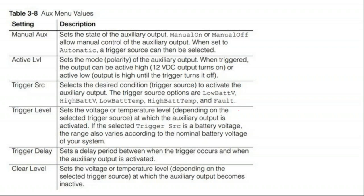And so the hardwired relays and circuits, there is some of that functionality built into battery inverters, just like there's that functionality built into thermostats. But it's a very binary level of control. If this state is like this, turn off. If that state is like that, turn on. And then not much additional flexibility to throw in additional variables.